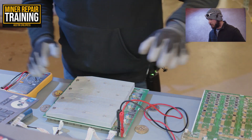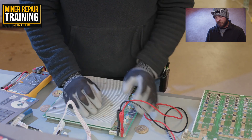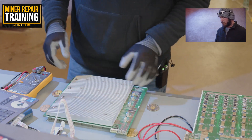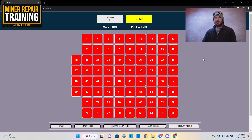Turn off the power and stop the test. To disconnect, do the opposite of the connection sequence: remove the data cable first, then the power lead, then the ground. That covers exactly what the Stasic tester does.